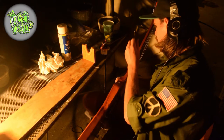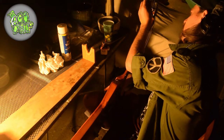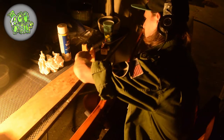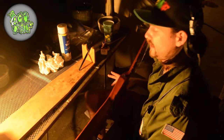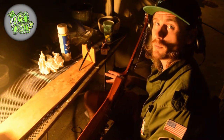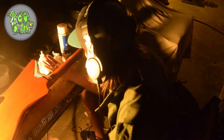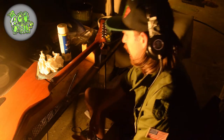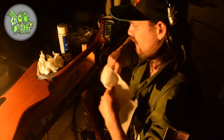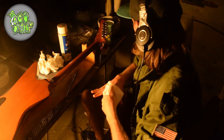This is starting to feel saturated - I can feel it sticking less and sliding more. When the oil feels like it's sliding across the surface, that's when you know the previous layer is saturating it. This wood is super porous - I just touched the dry part of the finish and it immediately tried sucking my fingers in because it really wants to stick to this finish I'm putting down. That means it's going to be a good solid finish - the wood's very porous, it's going to accept the finish, it's going to come out nice and be worth the effort.